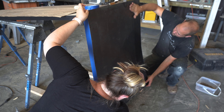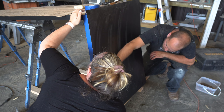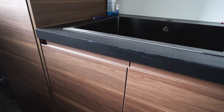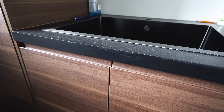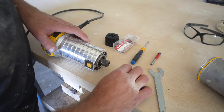When you're trimming the laminate on the top of your countertop, be careful to use the correct bit so you don't damage the edges of laminate you've already added. We used the wrong type of bit for this countertop and you can see that the edges are scratched and scored — we ended up having to redo all of these. We recommend a specific flush trim router bit which will be linked in the description box below.